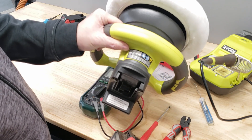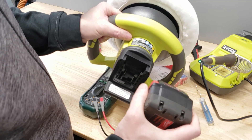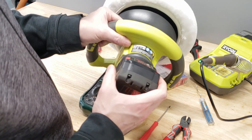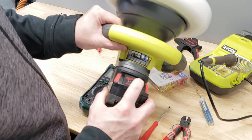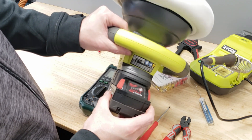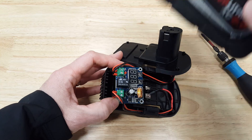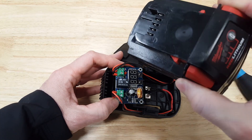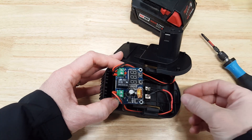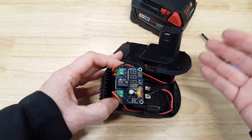I'm going to take this battery out. If it senses that the battery is two volts more, it'll run. And there's my low-voltage cutoff. Of course, if you put a fully charged fresh Milwaukee battery in there, it will sense that it's more than two volts over the cutoff voltage, and it will turn on and run.